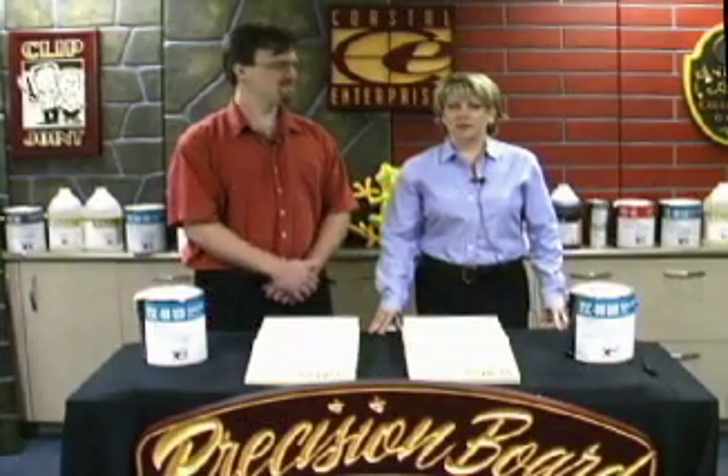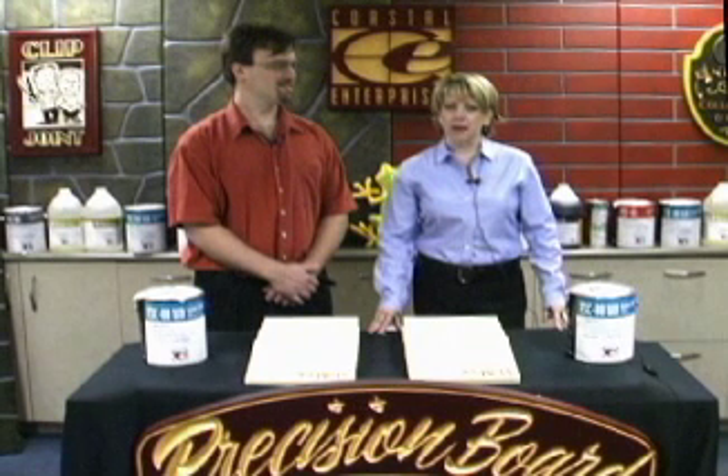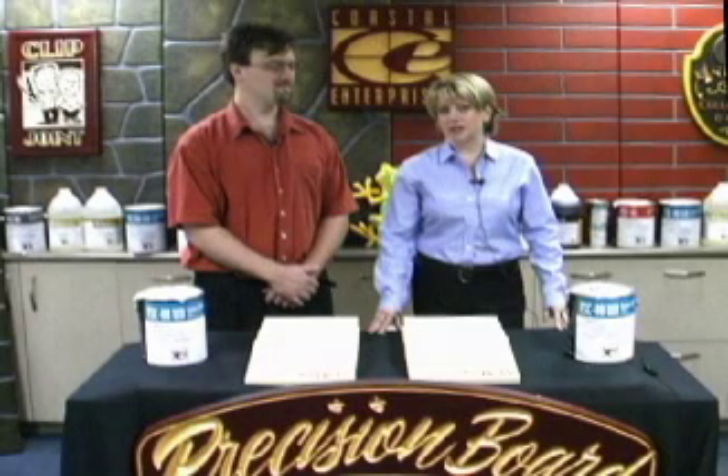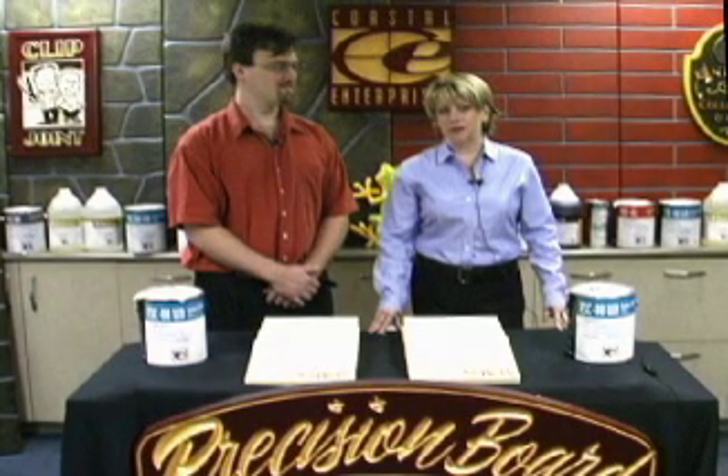Another great thing about the FSC88WB is that it's compatible with all types of paints, which means anything will adhere to it, such as solvent-based enamels, acrylics, and even automotive polyurethanes. A lot of people think that because FSC88WB is so much thicker than other primers that you're limited in the way that you can apply it. As a matter of fact, you can brush, spray, roll, or even squeegee it on.